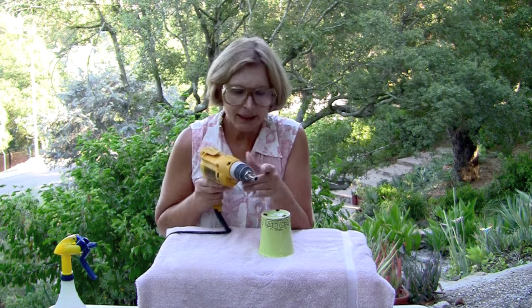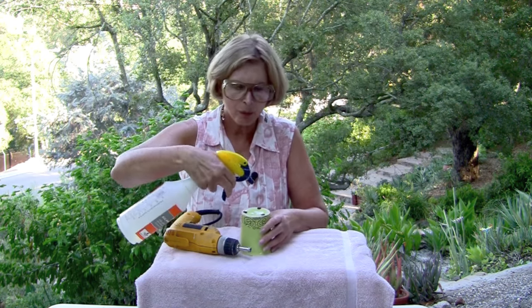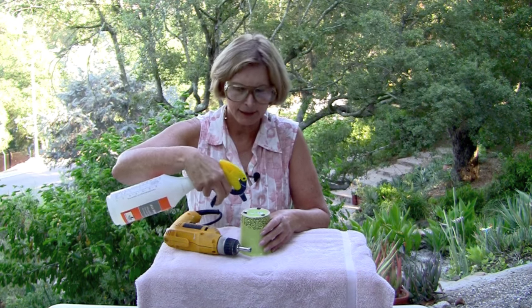Now this is not plugged in when I was doing that, for safety's sake. I'm using a towel as a non-skid surface because things will splash and splatter, and you never know exactly what surface you're working with and its propensity to shatter. Wear safety glasses. There's going to be a lot of friction when this drill bit hits that ceramic — it's going to get really hot. You want to keep the area moist and wet to cool it down.